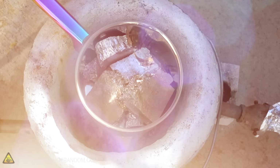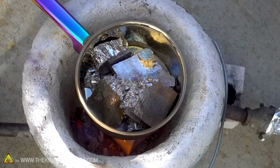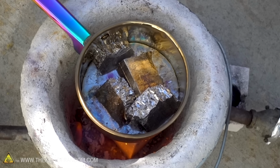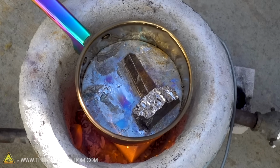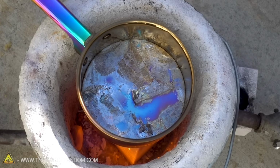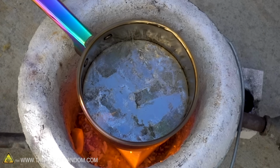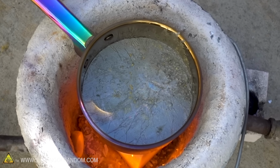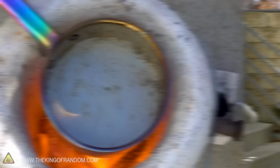Let's try melting it and see if we can get any crystals out of it. This melts at 520 degrees Fahrenheit, but to get the best results with making crystals, we were told we wanted to get up to 700 or 800 degrees Fahrenheit and to look for a certain color change in the surface. Instead of just doing it on a stove, we're actually going to use our foundry. We think that'll go faster, get to a higher heat. Then once it's melted properly and we've got it all set up to make the crystals, we're going to let it sit in the foundry in the same spot, which should insulate it a little bit, help it cool down slower, and we were told that also helps with better crystal growth.